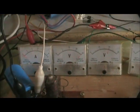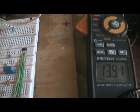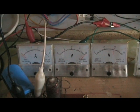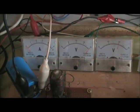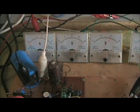I've got it set so that it comes back out of float mode at 13.8 or more volts, just to demonstrate this, but it should be down a lot lower than that. The small motorcycle battery that I'm charging is able to be kept up at a reasonably high voltage just by the float pulses.